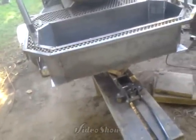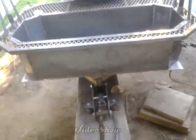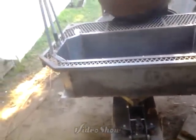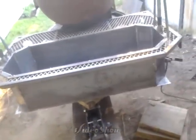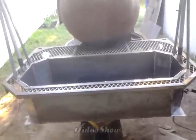I put all the pieces in around it, put a jack under it, held that rectangular bottom up. I'm going to come back and trim these corners out. I think it's ready to weld. I'm going to brace it back from the bottom to the trailer frame, make it extra stout. Then I'm pretty sure it's going to be ready to weld and on to the rack and figuring out the rest of that thing. I may have to add at least one more part to this video - this is a lot of damn work going into this thing.